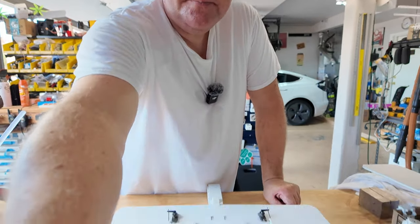When the wiring comes forward like that, you can see. You should have the battery connector. This will be the DC power from the battery eliminator circuit. And then the ESC signal line, signal and ground. So that's what should all be coming forward. Having this nose open just makes it easier to put tools in there and get to things.